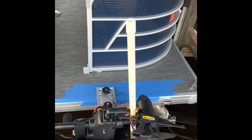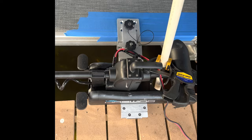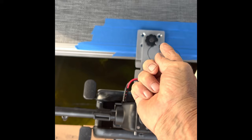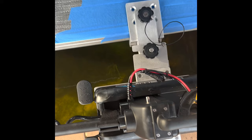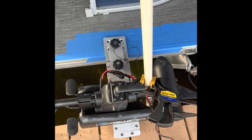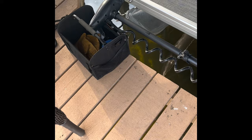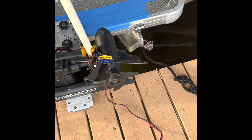Having decided to put the Tune Troll bracket and trolling motor mount on the port side of the boat, you have to consider this as a dimensional problem — X, Y, and Z. On the Y-axis you have no control; the bracket has to sit up against the skirting, and since I don't have a rubber gasket that's not a problem — it fits tight against there. On the X-axis left and right, I don't want the bracket to be a trip hazard, and the propeller/motor section when stowed has to be well within the bounds of the sides of the pontoon boat — you don't want it hanging over the edge.